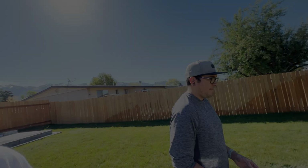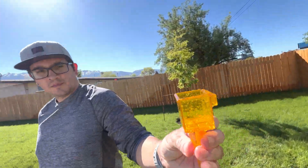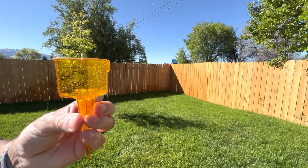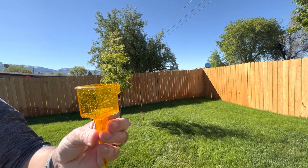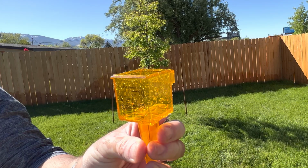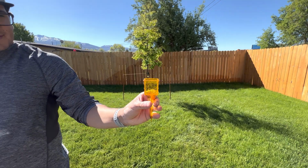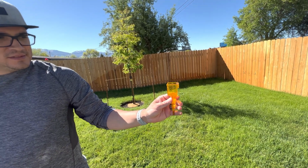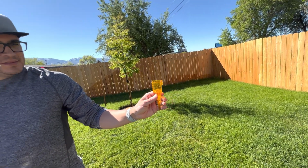As soon as you get done running your cup tests in your yard, you're going to come and collect them and look at how many inches are in each one of these cups. This is what that looks like. That is super light in that cup right there. In person that looks like about an eighth of an inch, because the water is beading up; if we put a little dab of baby shampoo in it, it breaks that bond. In this area right here, he's going to need 80 minutes worth of water. There are a couple of fixes that we were talking about on his sprinklers.